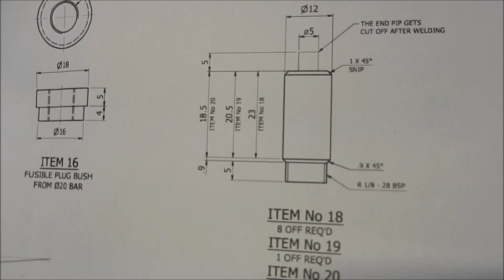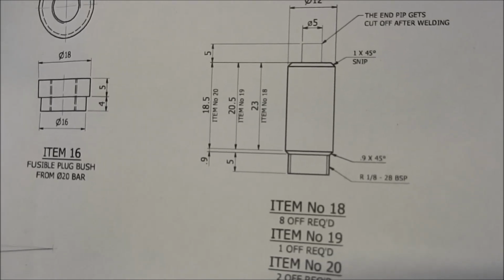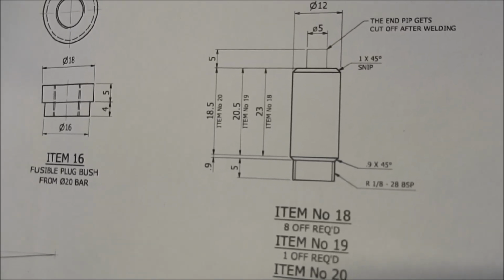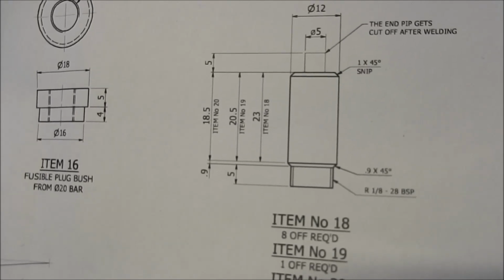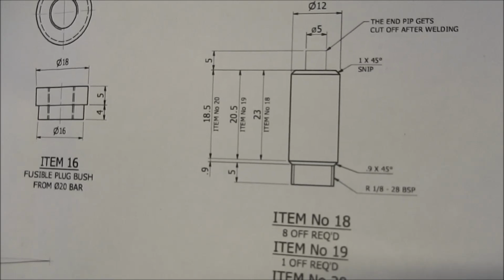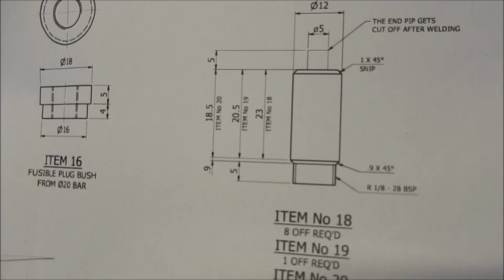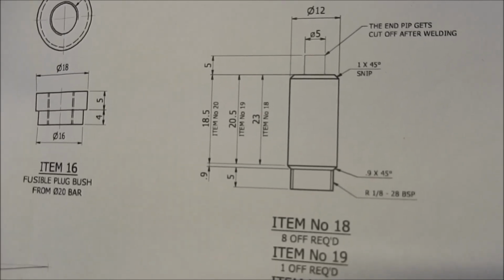These are the stays for the side of the firebox. In any pressure vessel, which this is, where you have flat surfaces that are impinged by the pressure, you need to support those, otherwise they're going to blow out or belly out. So we put stays into those flat faces, particularly on a locomotive style boiler, to prevent that from happening. There's a number of formulas that are used to work out the number of the stays and the pattern that they need to be in.